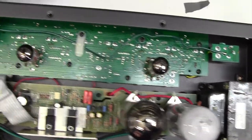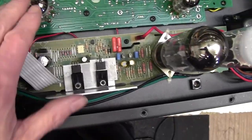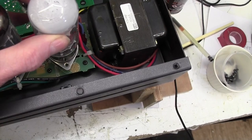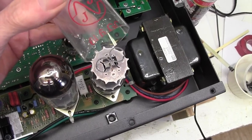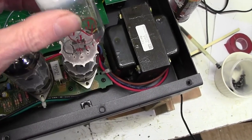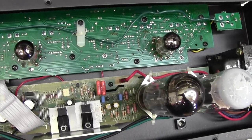That wasn't too bad — there were a mere 12 screws holding that plate on, but when I took them out the plate just came off beautifully. There's the inside; here are the preamp valves. I went to take this valve out to see if I could discover the hairline crack, and when I went to pull it out — I think I might have discovered a hairline crack in this valve. Yes, definitely. Slight crack there allowing the air to leak in. So that's shot — that's got a new one in there. I'm not going to bother about that valve at the moment; I want to see if I can find this field effect transistor.